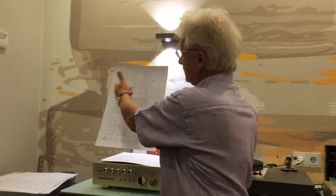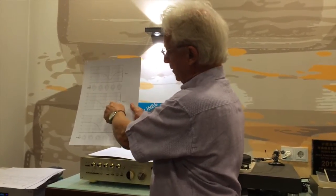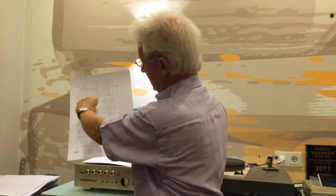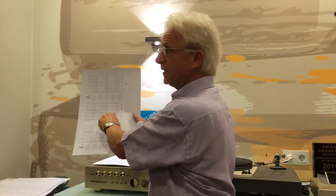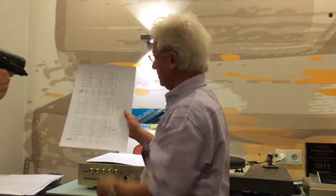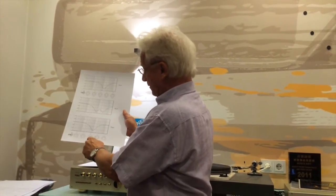Now this gives you the response of a typical equalizer. I'm not mentioning any names, you know. But what you have here is the typical attenuation. Too early, as you can see, we're attenuating frequency which we shouldn't attenuate. And at the frequency we should be attenuating, there's a bump. You know, this is a typical feedback equalizer. And this is what we can do now.